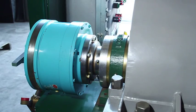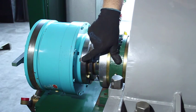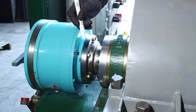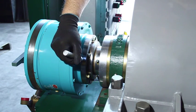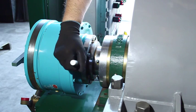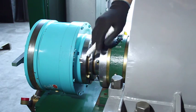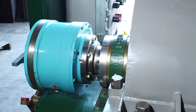For this step, it's very important that you always look around the gearbox for alignment shims. Here we have a good sample of an alignment shim. It's also important to preserve the balancing on the unit, so mark the position on the gearbox. Let's make two marks on the side of the shim, which will help us align the gearbox and the shim back to their original positions.